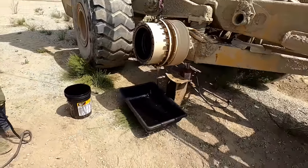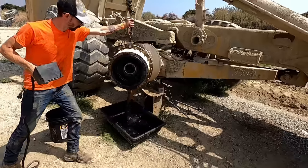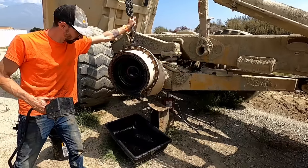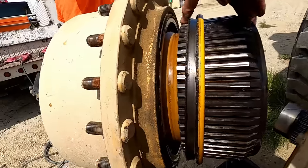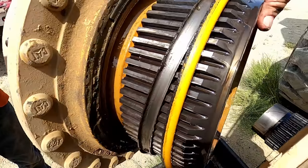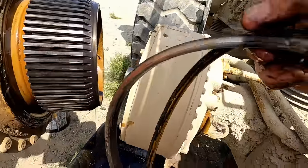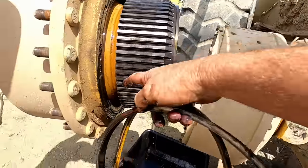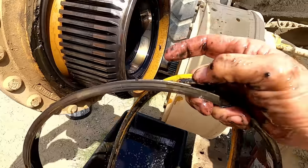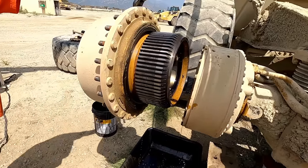That safety stand was in the way. I really don't need it because if the jack were to slip, the thing would only fall about a foot since it's tied together with the rear suspension — but we still put it in there just so it looks good for the bosses. Here's the lifetime seal. These things are about $1,800 from Cat now, which is an outrageous price. I was hoping it was going to still be in good shape, but you can tell it's pretty wore out. It's sharp — metal on metal right here. It rides on this half of the seal; this is the one that came off the hub. We're going to replace it — I've got a new set for it.